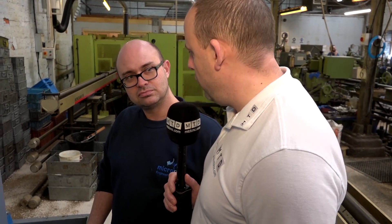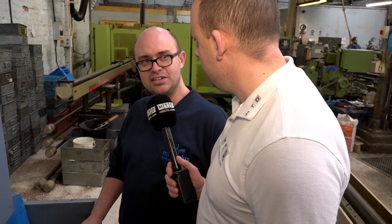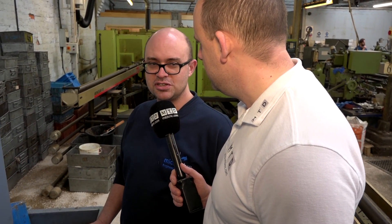Does it have any bearing on the final tolerance of the part or the surface finish on the components? Not really, to be honest. There's a slight difference in surface finish on some materials, but the majority of the time you can't tell the difference. There is a slight alteration in cycle time, but you have to weigh that up against having the door up and getting the swarf off, versus having the machine running as you want to — which is a complete pain to keep going back to.